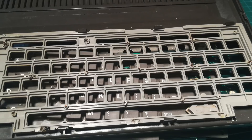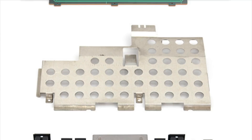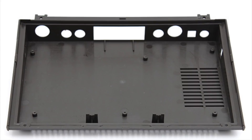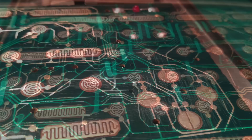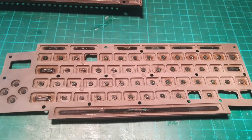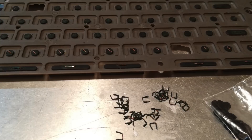To understand how it all fits together, let's look at an exploded view. It's incredible to think they retailed this at 99 pounds in the UK. The keyboard PCB makes contact with the keys. The previous owner tried to improve conductivity but went a bit crazy with sandpaper. They also used U-bent copper staple things to improve conductivity on the pad side under the key, but over time that copper has corroded and oxidized.